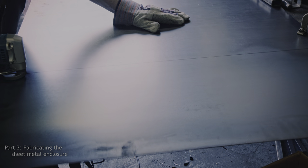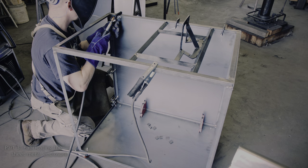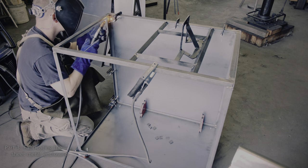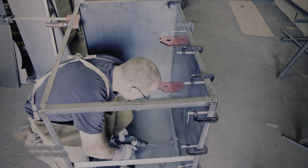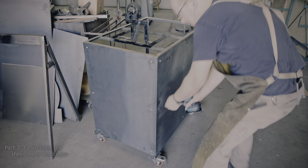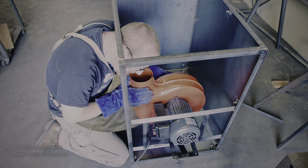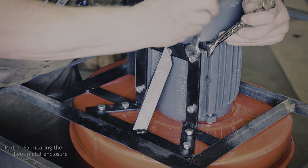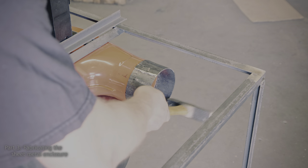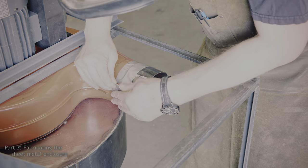Cutting 16 gauge sheet metal with an electric shear is quite challenging and takes a fairly long time. Better tools such as a plasma cutter would certainly be nice. The process for attaching the panel is the same as before: little tack welded squares that receive screws to attach the panel. The next step is to place an inner wall that separates the dust chamber from a filter array that cleans the exhaust air. Duct tape is of course an essential ingredient to any project and needs to play a crucial role here as well.